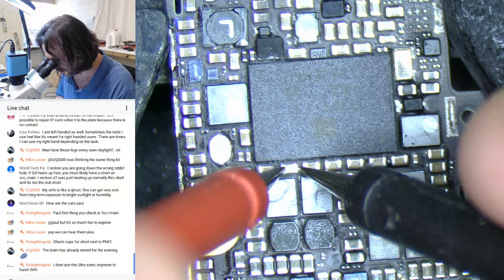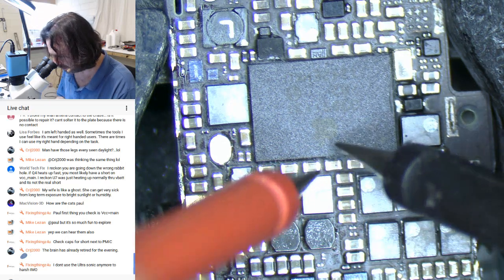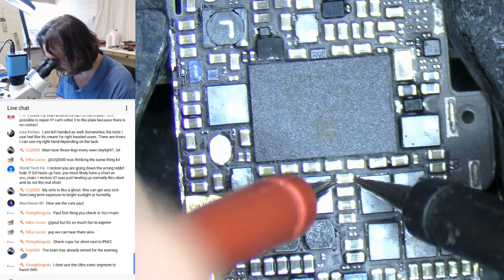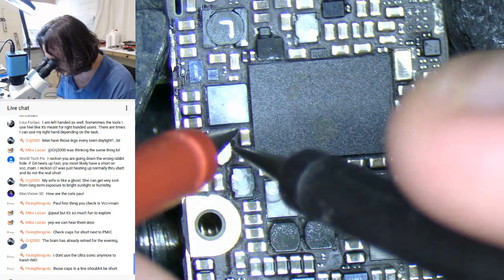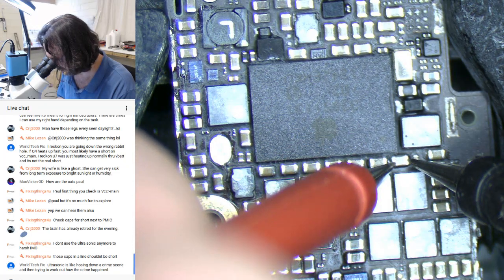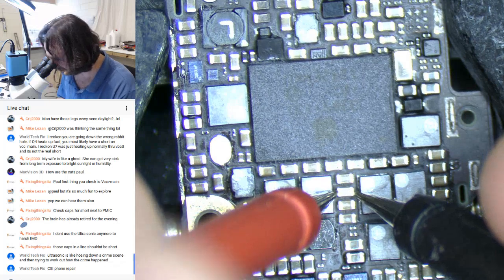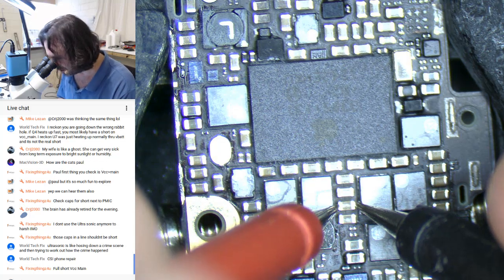And you're short, and you're short, and you're short, but what is your actual resistance value? Oh, I can't even hold them steady. A nice, soft zero. Okay, these are all 0 ohms. Yep, that's all zero. Because, I mean, obviously with things like GPU and CPU, you expect anything like 20 to 30 ohms, maybe a bit less. But you really don't get zero.